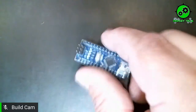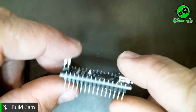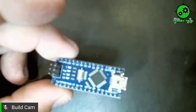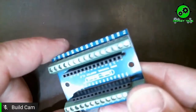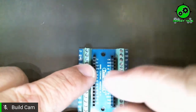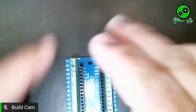We also need a four double-A battery holder, and an Arduino Nano. The ones I put on the page were actually pre-soldered as well, so if you cannot solder, they actually come pre-soldered with all the pins in them — you just have to take it out of the box and upload the code to it. And then we have a terminal board; the Nano will actually slide right into the terminal board, and then you just have to put the batteries in and you'll be ready to go.